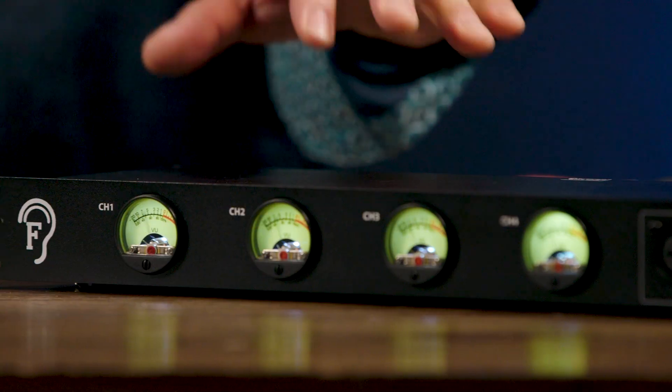To begin, we have four analog VU meters. You can access these with XLR inputs on the back, and there are also XLR pass-throughs. These are designed so they don't affect the audio quality in any way. A VU meter gives you a nice average readout of what's happening. It's not quite as fast as most LED meters, so it gives you a good average level readout, and that's very useful when you're setting your levels going into your DAW, when you're working with microphone preamps, and when you're working with other hardware gear as well.